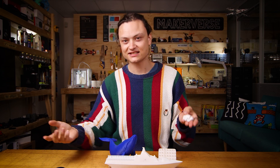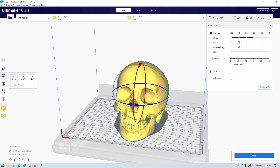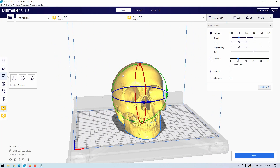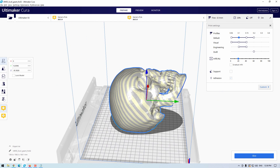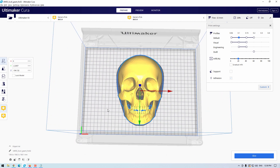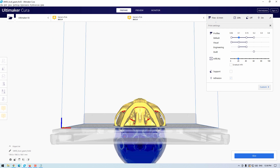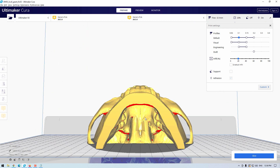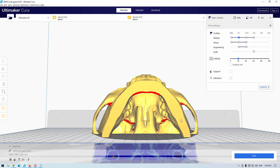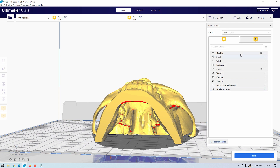Jumping into Cura now, we can see the STL file of this skull which I wanted to be printing facing up out of the print build platform but with minimal to no supports. When you view it from across the platform you can see that the anatomy is correct and the jaw section makes for a very big overhang. You can see highlighted in red all the overhang areas which will struggle to 3D print correctly — these are the sections that are going to be altered by the make overhangs printable setting.